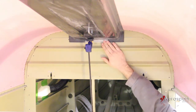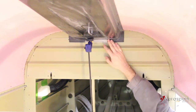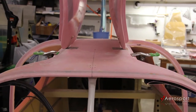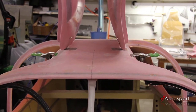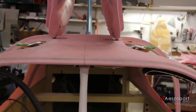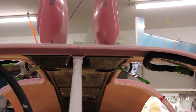You can see I also have a piece of tape on the overhead console itself with the center line marked out. Just line those two up — I'm using a spreader bar to hold that in place temporarily. Here at the front of the cabin top, you can see I've got the center line drawn out. I was able to find that just by measuring between the openings of the doors, then pulled that line forward, wrapped it down around, and used that to locate the overhead console in the cabin top.